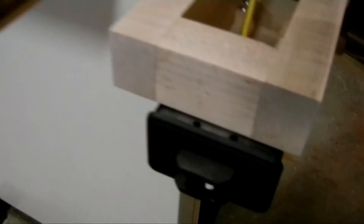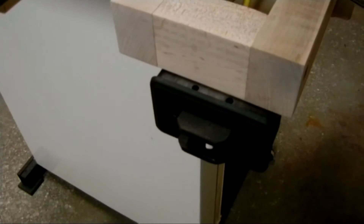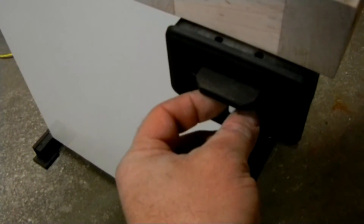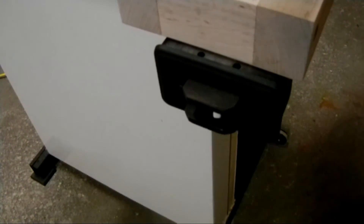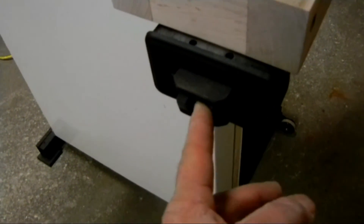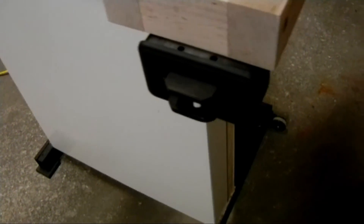Here's a better look at the power switch. It's just a normal light switch. The chances are that this will not last long — because even though the switch is rated for 15 amps, the saw motor on startup uses quite a bit more than that, and so they'll burn out quite regularly. It depends upon how often you use the saw.